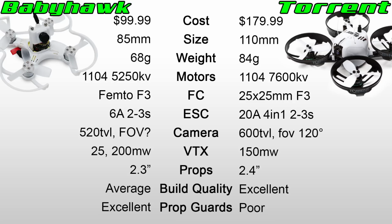Cameras are very similar. I might give an edge to the Torrent on the camera. It does seem to be a little bit nicer, but they still have the same drawbacks on cloudy days and sunny days. And the VTX definitely goes for the Baby Hawk because you have a choice between 25 and 200 milliwatts. As for the Torrent, you're stuck with 150 milliwatt in the US, and of course in Europe you're stuck with 25 milliwatt. Prop sizes, the Baby Hawk's a little bit smaller. And the build quality, Baby Hawk, I give it average. It's nothing special. Now with the build quality of the Torrent, it's much nicer, but it's also $200.